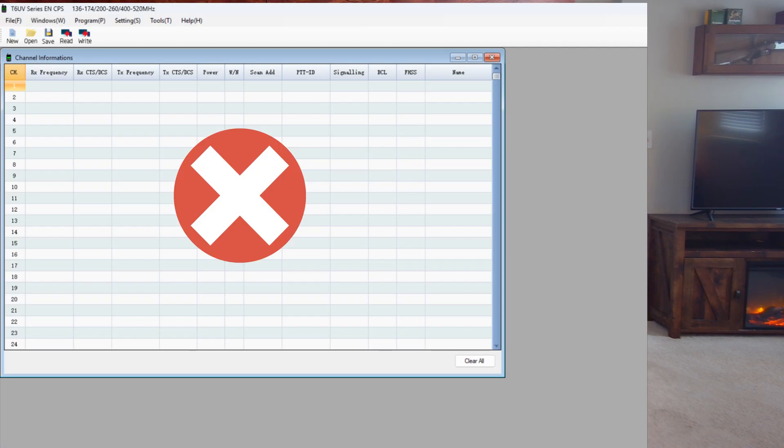If you're purchasing a radio that doesn't connect with CHIRP, they're going to make you use something else — probably called CPS — or it'll have its own proprietary programming software. The problem is it doesn't have searches, pre-programmed GMRS channels, or the merged channels you can just pull right from CHIRP and drop into the grids. You end up spending countless hours typing each frequency, naming it, adding the offset, the duplex, all the tones — it just becomes a major pain.